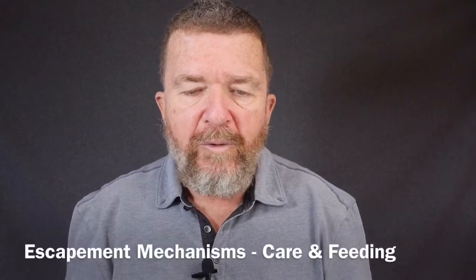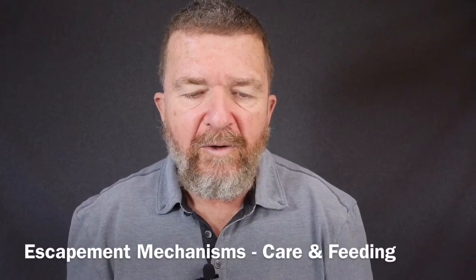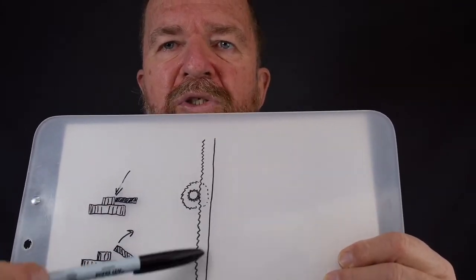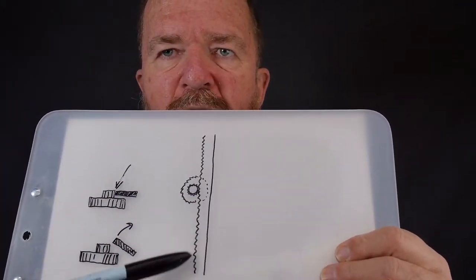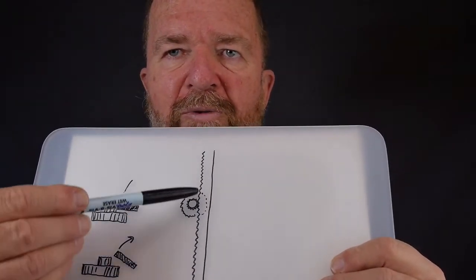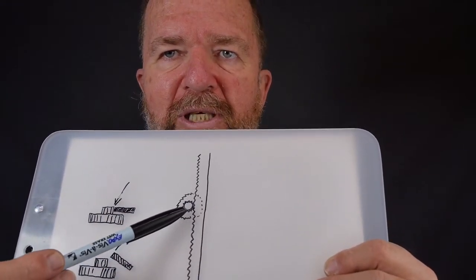The main subject of this video was inspired by the problems I was having with the Hermes Rocket due to wear on the escapement gear and the linear rack gear. This is a design common to many brands. Looking at this drawing — starting on the right — this represents the linear rack gear that runs underneath the carriage from left to right. One edge has teeth on it, so it's a toothed linear rack, and it engages the escapement gear.